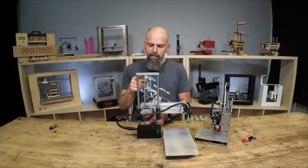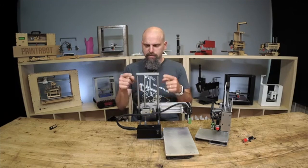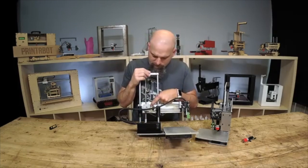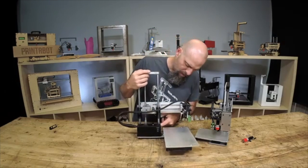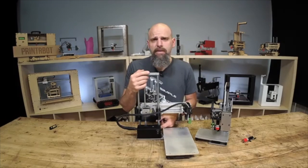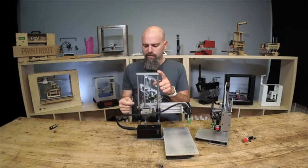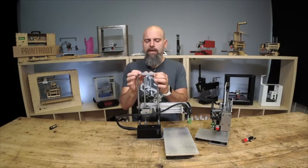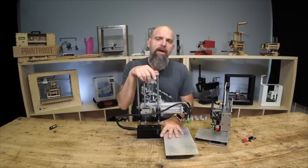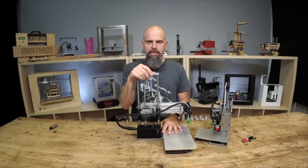So you get a new coupler, an Acme rod, the bars, the 2 aluminum pieces. There's a little Delrin spacer here, and then there's a metal piece down here as a spacer. Those spacers, we can water jet or laser cut and minimize our cost on the aluminum, so $100. So we got upgrades of $180 here on a $298 bot.